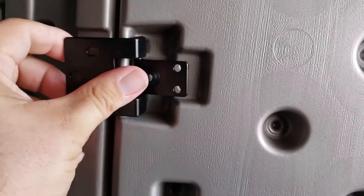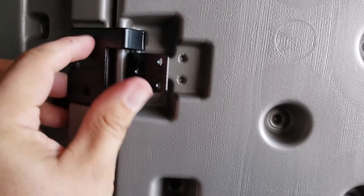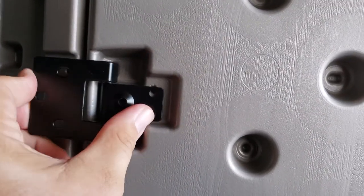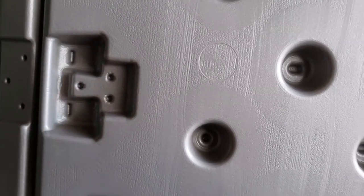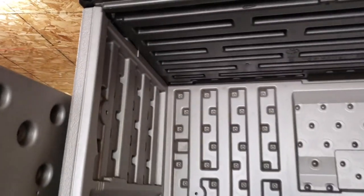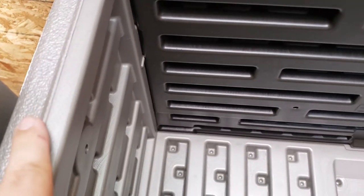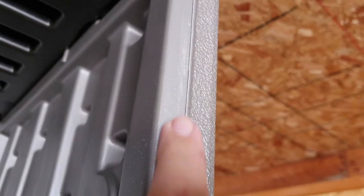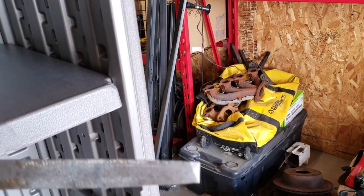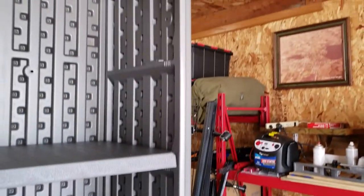Luckily the way this is assembled, when I screw this part here in it should suck the wall in. So this bracket should help make this function better. I took the doors back off to show this — this is one of those situations where you gotta modify stuff. On this side it's nice and smooth and just rolls right over, but on this side there's a pretty good shadow and a quite pronounced ridge. It's significant enough that I can hook it with my fingernail, and I think that's causing the door to catch and bind. I'm going to take a file and go to town to see if that fixes the door closing problem.